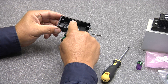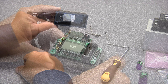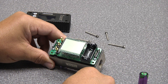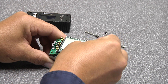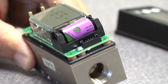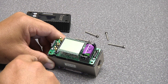As you can see, we have very close tolerance clearance between the circuit board and the inside of the case. Paying attention to the battery layout in the battery holder, you can pick your battery up and slide the negative side in first and then push down gently on the positive side. The display will come on just to give you a quick diagnostics.